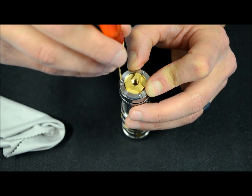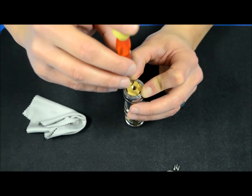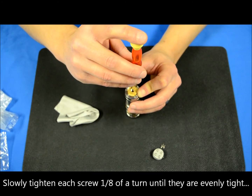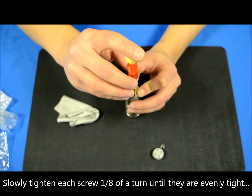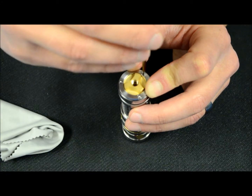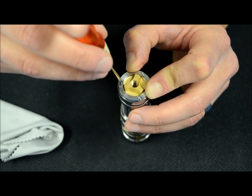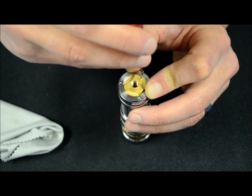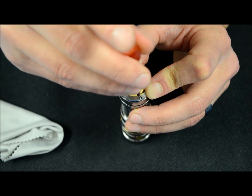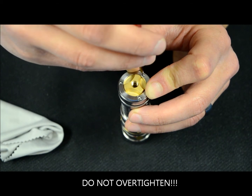There's a little bit of tension now. This tool has a pivot head on a swivel so you can use your thumb and middle finger to torque the tool. As we start to get tension on the ring, lessen the amount of turns — go about an eighth of a turn on each screw, keeping in the same order. If you go back to when you removed the screws, you could probably feel that they weren't on with a tremendous amount of torque, so it doesn't take a tremendous amount of torque putting the new switch in either.